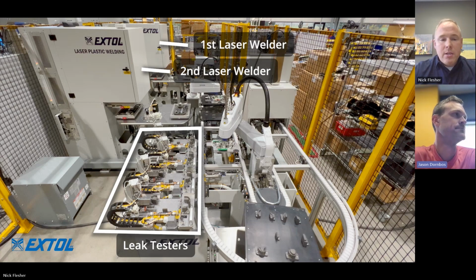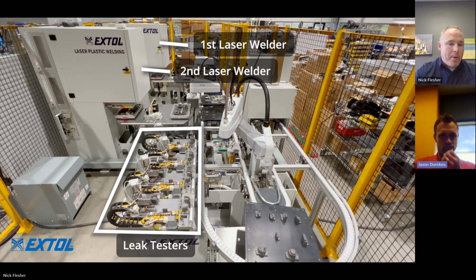We have seen, especially for those with natural nylon, you do need to have clean parts and not have particles on them or they will burn. So you can still get good welds, but that burn might over time create some challenges in the tooling.